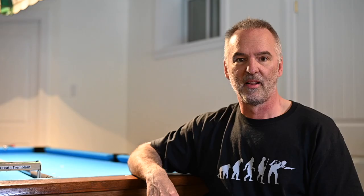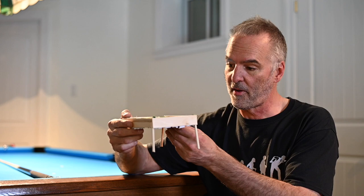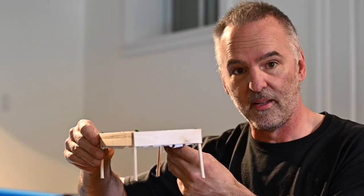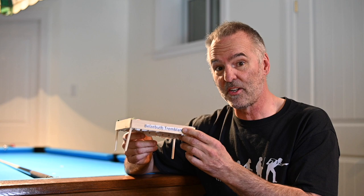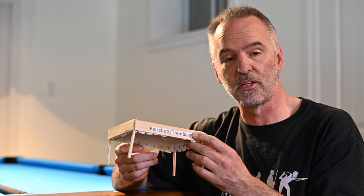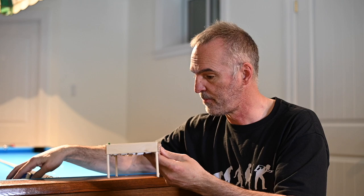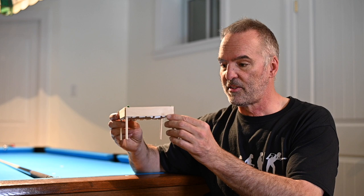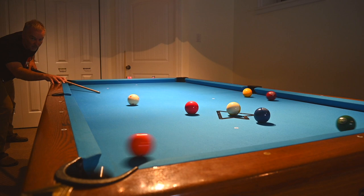Not really the solution I was looking for. How hard can it be to move a 600-pound pool table? Let's break the problem down into smaller parts. I've got my pool table, a wall here, a wall here — I need to move laterally 24 inches: position A, position B, position C. It needs to stay perfectly level. I also need to move the table fast enough that it won't interfere with regular play — about six seconds from when I take a shot to when I walk over to a new position. And once it's in position A, B, or C, there can't be any lateral movement if I lean on it. I'm 200 pounds, and I put about 35 to 40 pounds of pressure on the side of the table with my belly. It needs to lock into position.